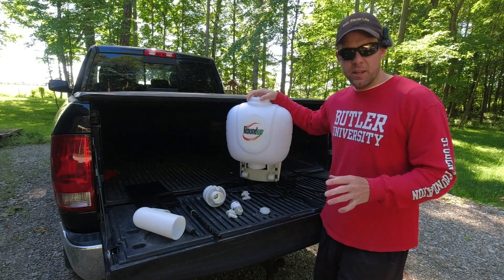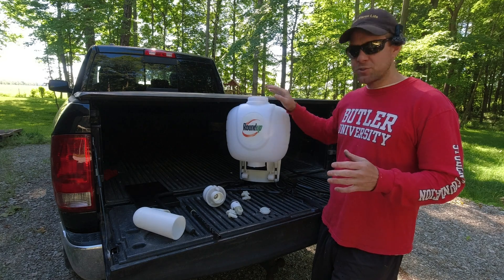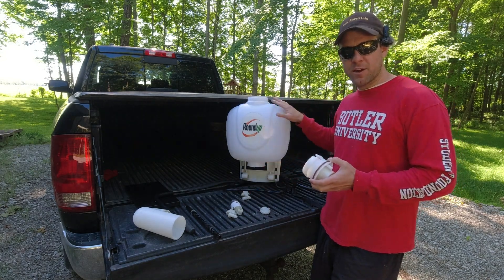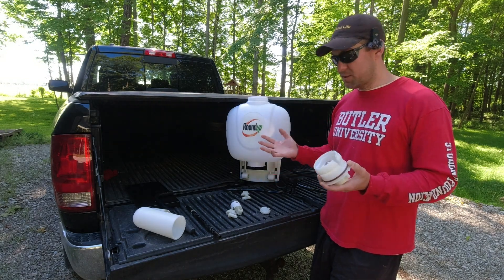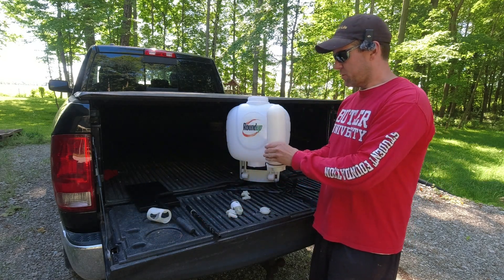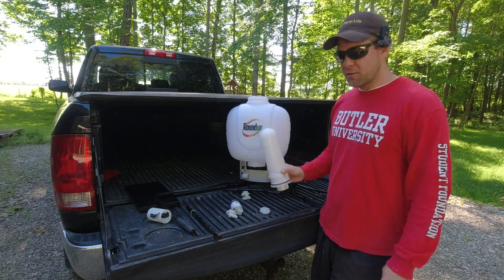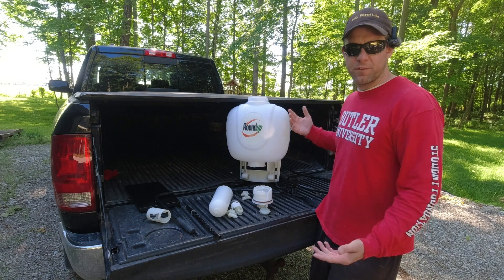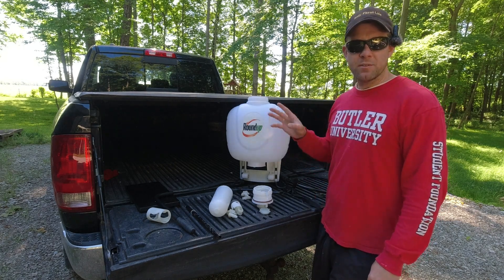I know that was very quick and dirty. If you happen to have this exact model, hopefully that's helpful. If you have another model, just know that you're going to need to eliminate the pressure tank from your actual sprayer in order to let the fluid gravity-feed. Another nice thing is that when you start taking this giant piece out of the middle of there, you actually gain a little volume in your sprayer. It'll make your side markings off a little bit, but you can always fix those. All right, so let's go look at the meat and potatoes of this setup.